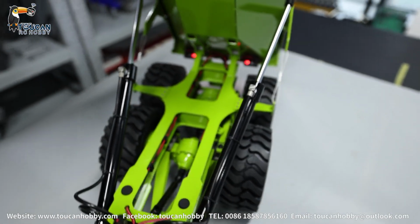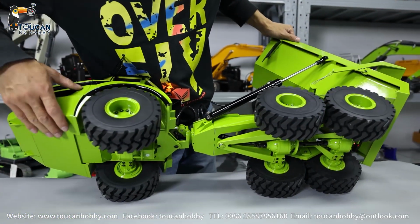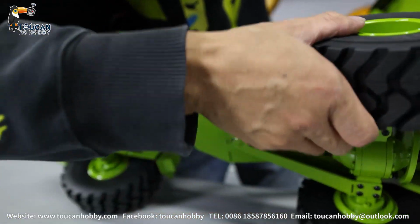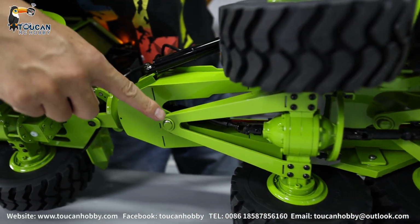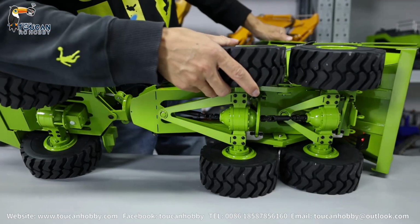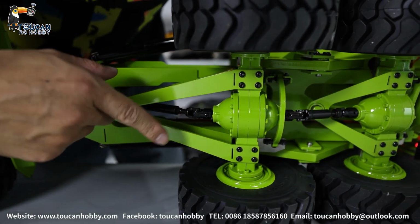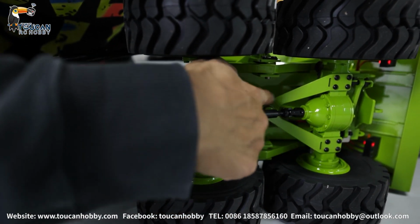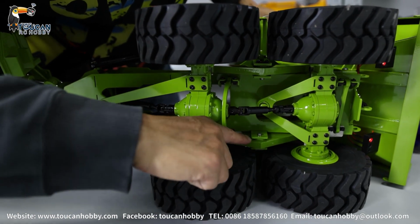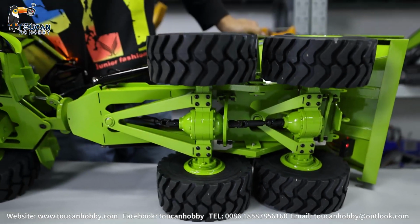Okay, so I will turn it around to see from the bottom. Hold with my body. Okay. It's the junction for this articulated turning here, we see for the chassis, it's turning by this junction here. Inside is a half ball shaped connection. Okay, so it's V type, this connecting rod to connect to the axles down at the rear part. So from here, you also have another one for the turning, the axle needs to turn. So half ball shaped junction connection. This bridge is a pin connection. Okay, this is the axle chassis.